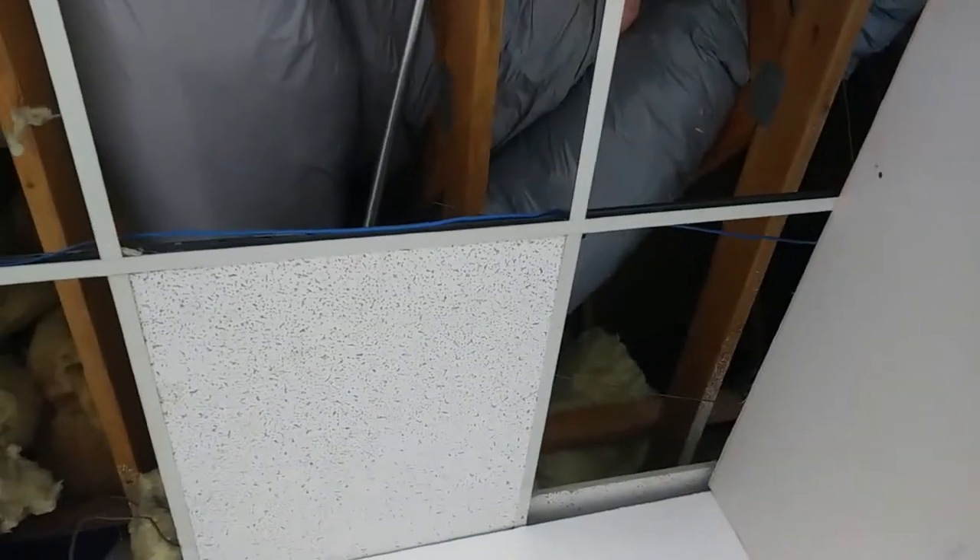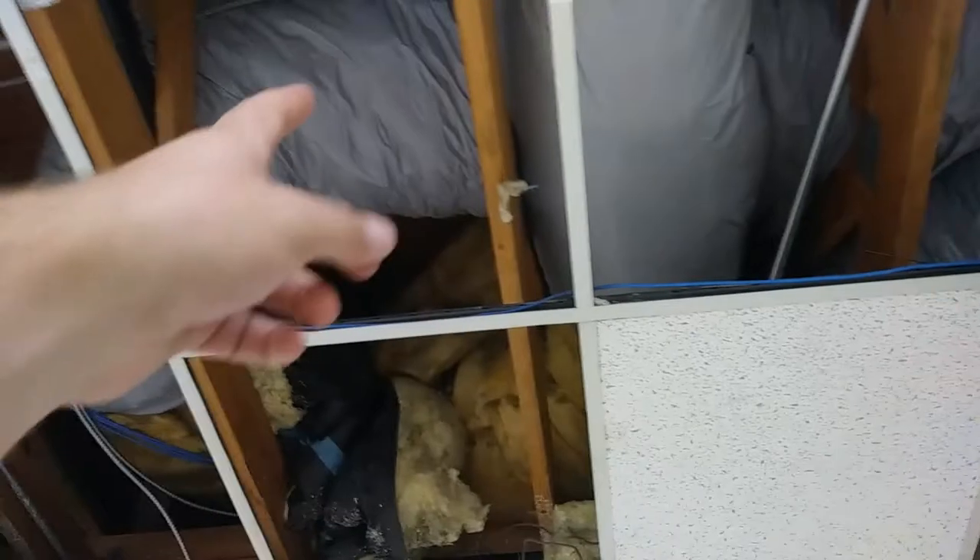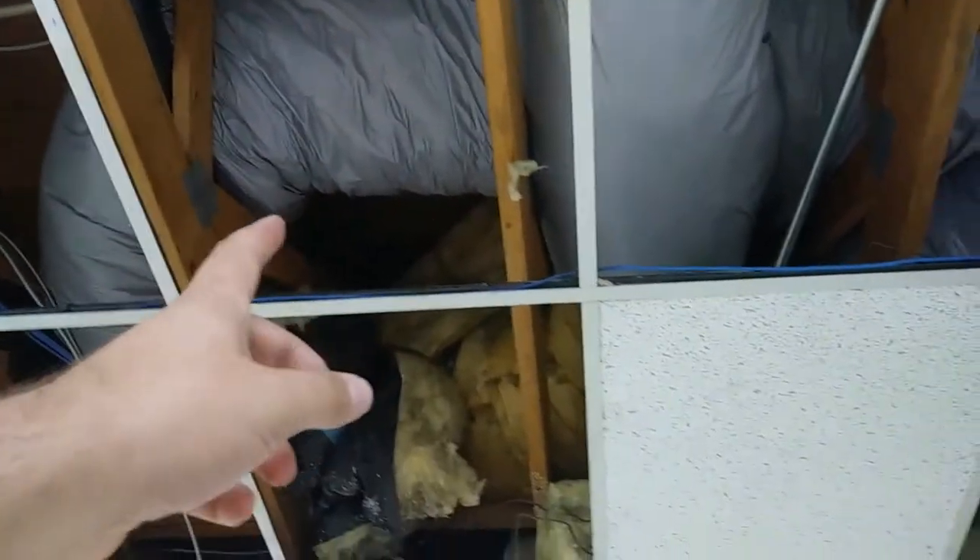We have another return over here. Since this wall is getting set up, there's an 18-inch that used to drop right here. It's all crunched up — this is as far as I can get it to stretch. So unfortunately I have to put a coupler. I'll probably put the coupler back here where it's easy to get at, because I have a whole box of 18 also. And I have to somehow force it over to that side of the wall. I hate flex duct — I hate duct work in general, but flex sucks especially.